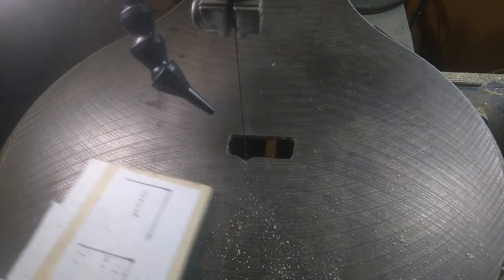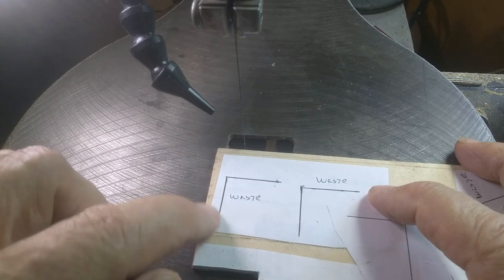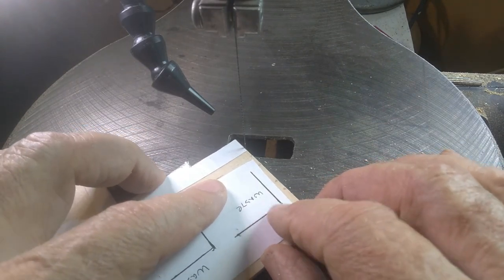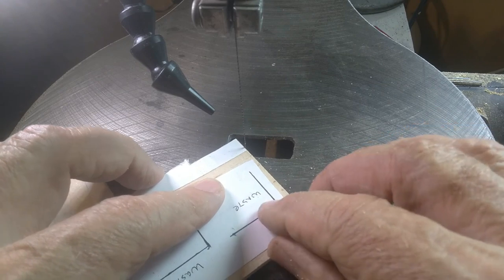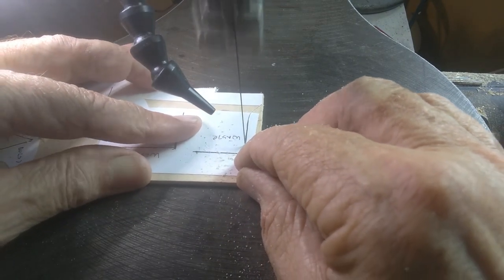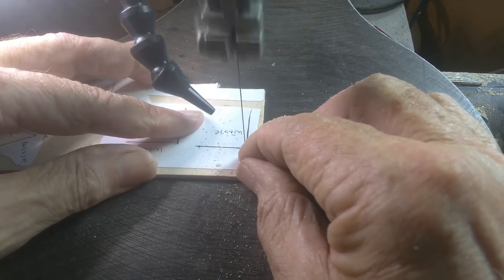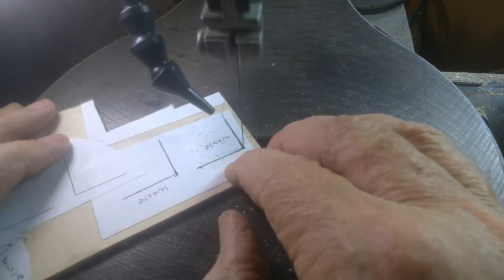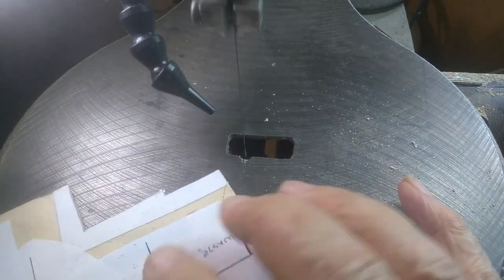Now I've got the waste on the inside, so I'm assuming this would be like an external cut and I'm going to make that sharp. There are multiple ways of doing it, but what I'm going to do is a little spin out — the waste is on the inside. I'm going to come in and cut me a little bit of a hole right there. You can do this on either an inside or outside; sometimes I'll just go into that waste, hog out a little space, make sure I've got it cleaned out, and then you can turn.